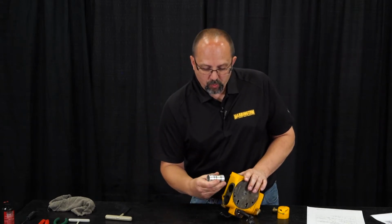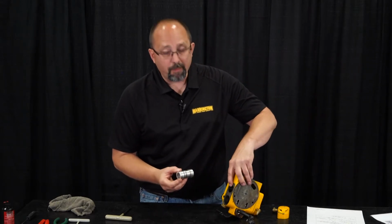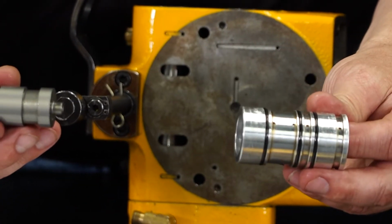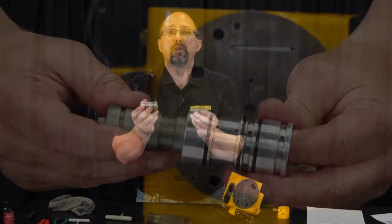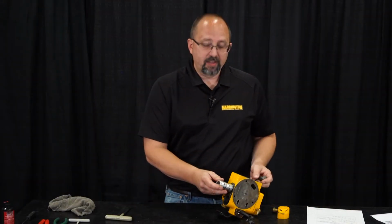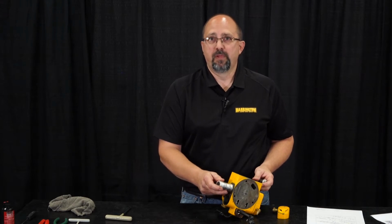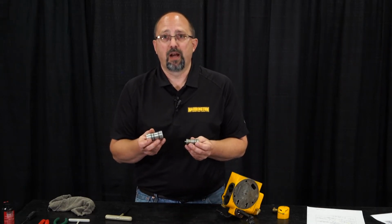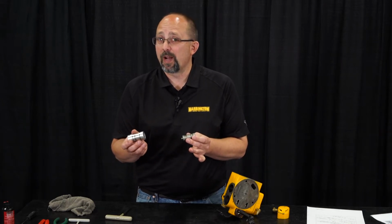Our brake spool and brake spool bushing go in the top chamber. So it's very important, the direction of these. This is what causes people to not have brake operation. Either of these components will fit into the valve body in either direction. They both have to be correct. Otherwise, we're not going to have brake operation, or we may have it in one direction and not the other.